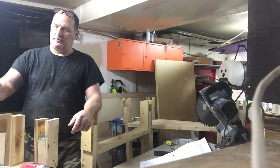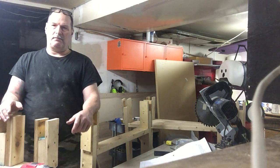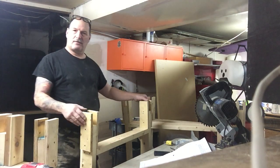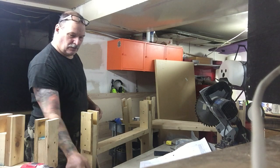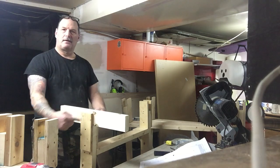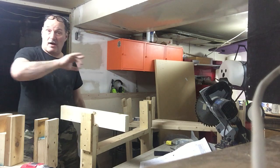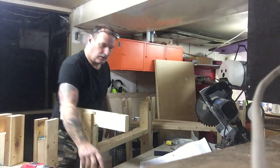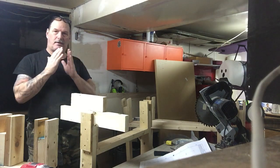And of course the single would come to the shorter one here, and it would rest. So everything's supported very well by the following stand. Now these will also be fastened with screws inside here. So basically, of course, we got this. The screws will go in here, as well as being leveled off with a level throughout all the stands before the boat gets built, of course. And this is, like I said, 2x8 material. It will run through here like that throughout the whole structure.